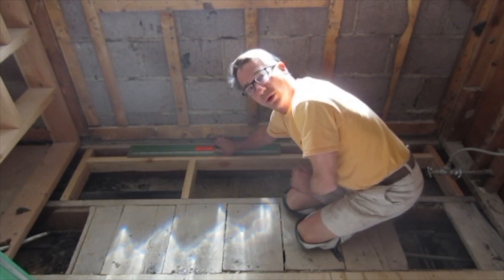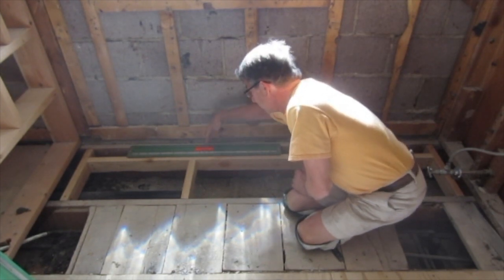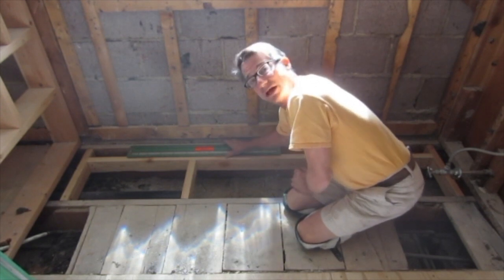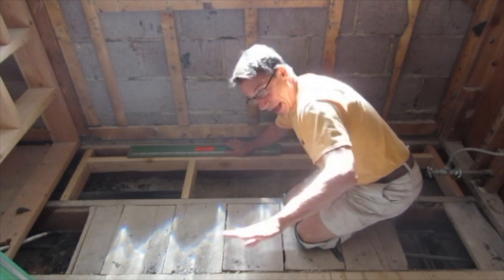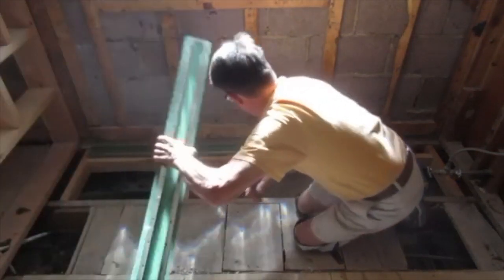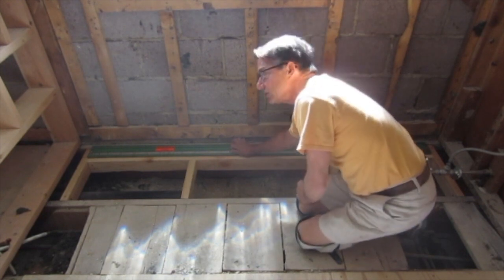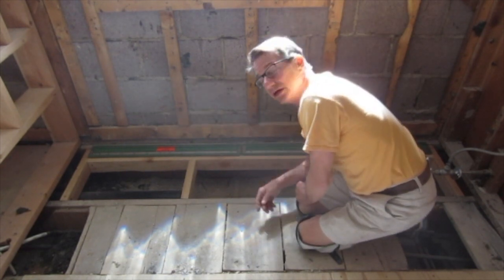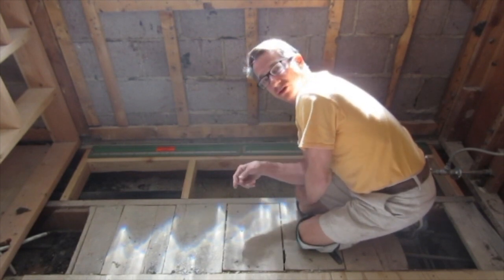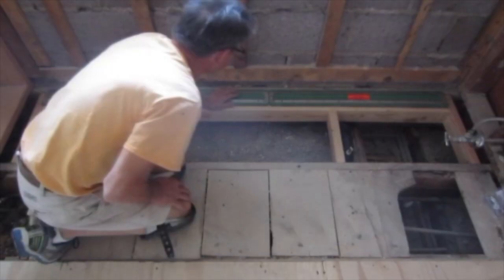You're going to want a little wiggle room so you can make sure that you have it straight to the wall, but not too much because there's screws that go through this outside lip that screw it down to the subfloor and through your fiberglass reinforced panel. I've made it pretty tight to the ends so that I have the ends of my drain supported to carry on the extensions that are going on the end, which will also be on top of the fiberglass reinforced panel.